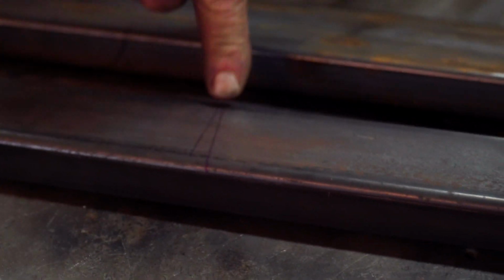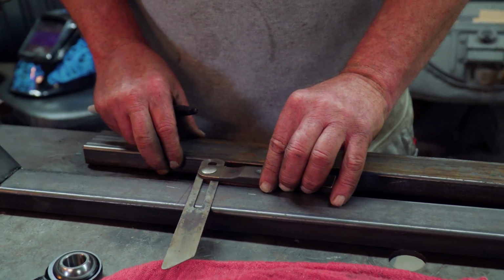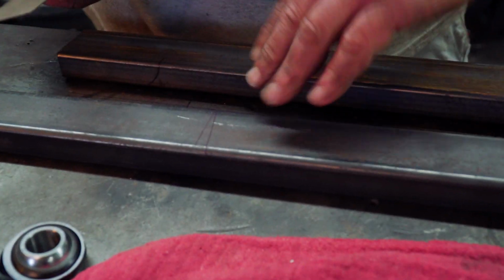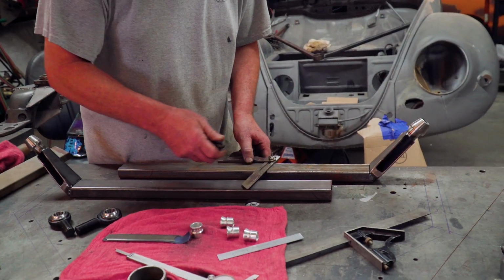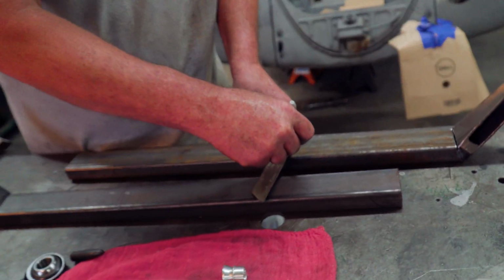This is where it's going to hit the frame right here, so measured up this angle. Yes, that's how we do it. So basically what will happen is I'll cut this off, but I'll flip this over, and that'll be our angle dropping down. We just locked it up over here with that line and everything else good. So got our sliding T-bevel, mark the other one, go over there and cut both of them.